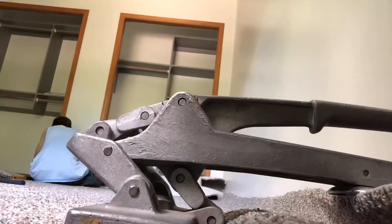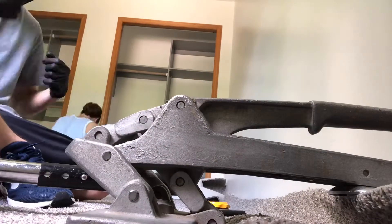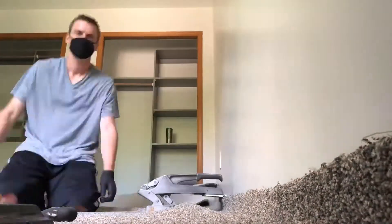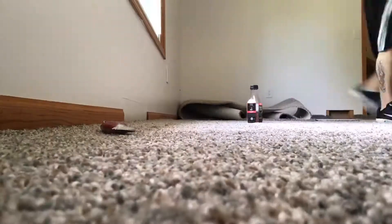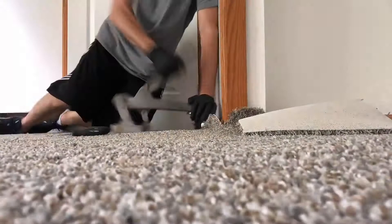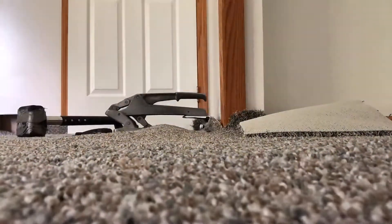We got our set wall set, here's our length stretch, we're going to go ahead and get that. We're going to have a tea break real quick, then I'm going to blast that on, work my way down, pull all that slack. This time of year it is so humid that we get those amazing stretches on the carpet — not like the wintertime where you try to stretch it and the carpet rips in half. Right about now, everything's like working with a piece of butter.